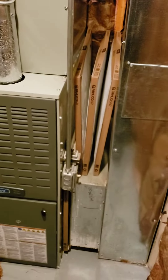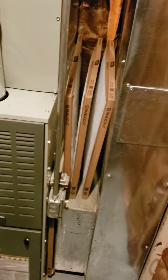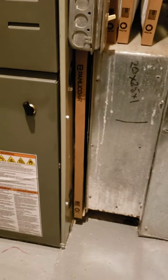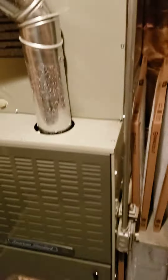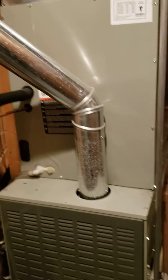Here's what I recommend. I just went to the store and got one of these $2 air filters — they're cheap and they let air through. They filter out the big particles, which is what's going to clog up your furnace, but they don't get all that little bitty stuff to where it's going to choke it down and restrict airflow. We've got a basic cheaper filter in here now and we're already seeing a lot better results — it's only been a few minutes.